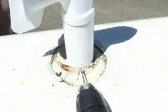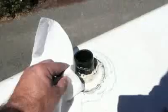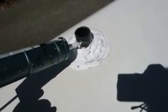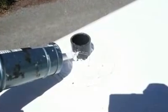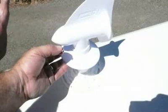The retaining screws must be below the new plastic collar, so decide in advance where you're going to drill the pilot holes. After you've drilled the pilot holes, thoroughly clean the area. Next, apply caulking where the new plastic collar will be affixed to the roof. Be liberal here. Place the new cap through the plastic collar, put it on the pipe, and secure it with three screws. Lower the plastic collar, and you're done.